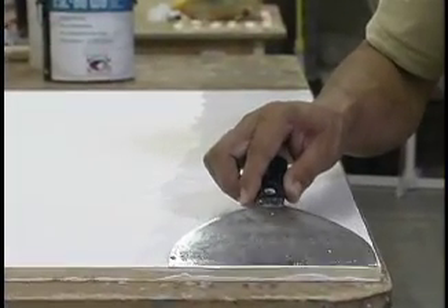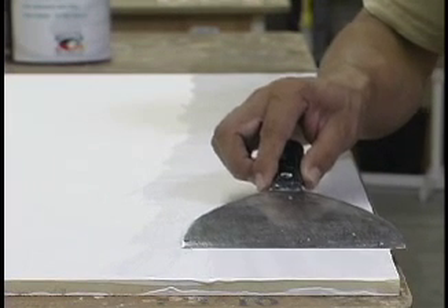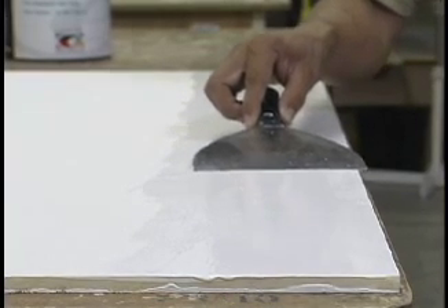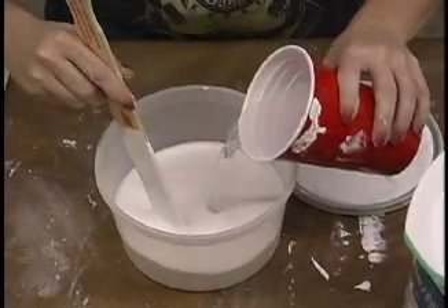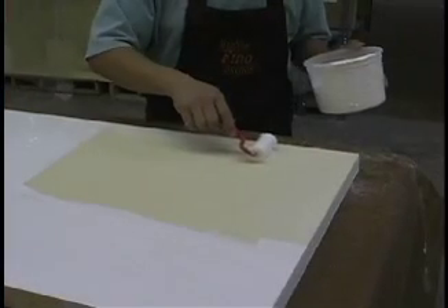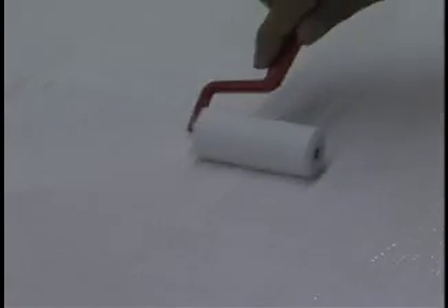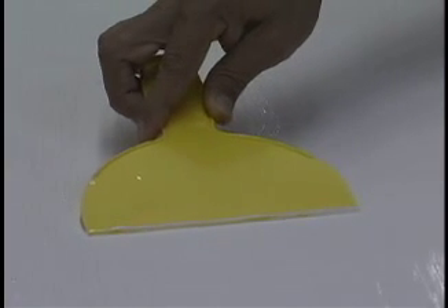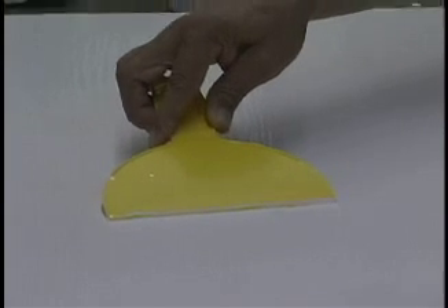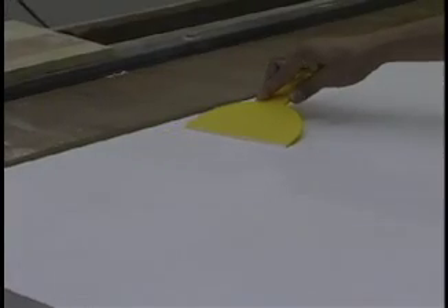You can also use a squeegee to apply FSC88WB. One of the great things is how versatile 88WB is. Many types of squeegees can be used, such as drywall, vinyl, or the spatula type — it just depends on your personal preference. You can either use it right out of the can or slightly reduce it with water. To start the process, pour the WB directly onto the precision board surface. Then take a standard short nap roller and evenly roll it out to cover the entire piece, making sure to work it into the surface to achieve total surface wet out. Using a light hand, pull the primer across the board with the squeegee to get a nice, flat, even surface. This may take a little practice, but once you have this down, the squeegee method can really speed things up.